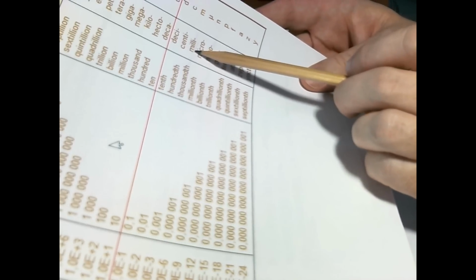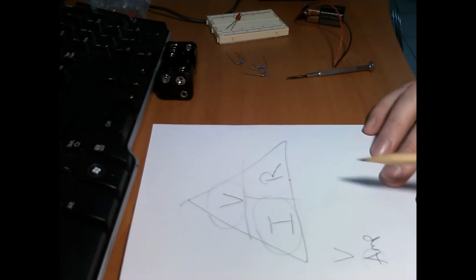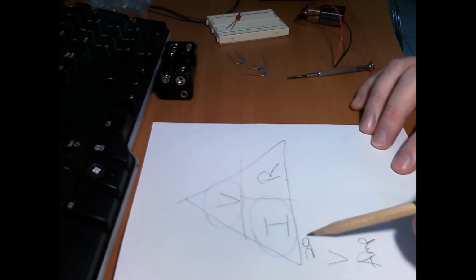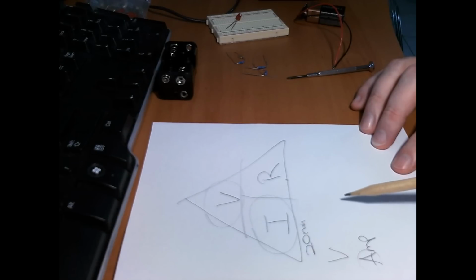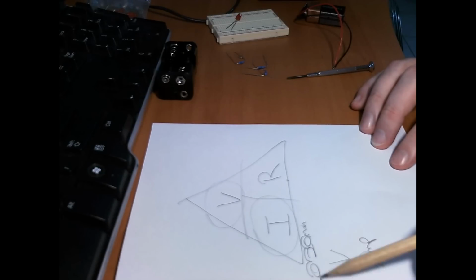What I have here, which is something I've downloaded off the net, which has helped me quite a bit, is a little conversion table. If I look here at milliamps, you can see it's got a little m. That's the prefix in full. This is the factor, so it's E minus 3. You can use a scientific calculator and put your E minus 3 onto 20 milliamps and it'll give you an amperage value. But basically minus 3, so easy enough for this one. We'll say we got 20 milliamps. Now minus 3, so we'll just move the decimal point: 1, 2, 3, bam, 0.02 of an amp.